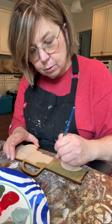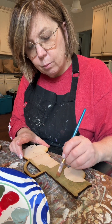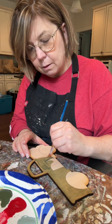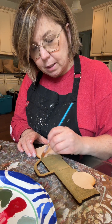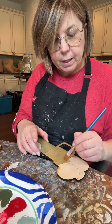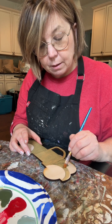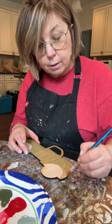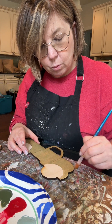I like this green because it's a little darker than what the camera is actually showing. I'm dipping into my water and pulling some paint from the puddle I made. If you use paint you don't have to move quite as fast. The reason I move fast with stain is because stain soaks into the wood — if you leave a line and walk away, it's going to leave a line you can't unsee. If it dries like that, even with a second coat you'll see it. So I try to move fast with a wet brush.